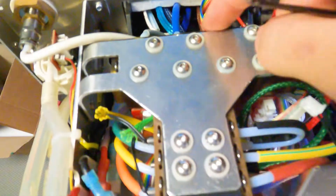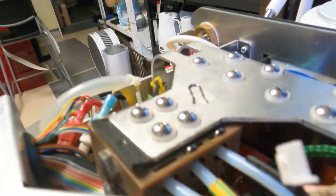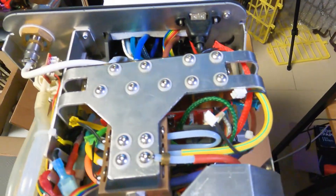Here is how to do it — there is a clip here. Put your tweezers in the gap, then just pull it out like this. Then you can pull the tube out. There is an orange tube and a white-orange tube inside, so you need to take the orange one out as well, but I'll do that after I take this part out. The same process applies for the other tubes.